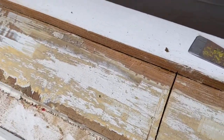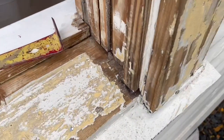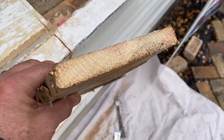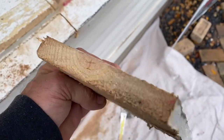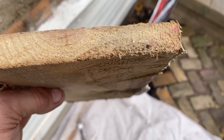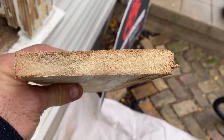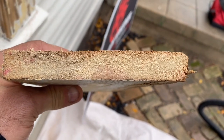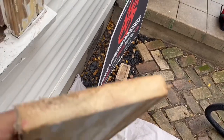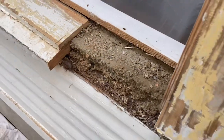I cut all the way through here — you can see it's pretty loose in there but it's not coming out yet. We've gotten that piece out, and it turns out it's just a regular piece of white pine. I don't know if you can see the rings on the end of this board, but it was installed with the rings so that they attract water into them. Typically you want to install a sill with the rings the other way — if you have a chance, don't do it that way.